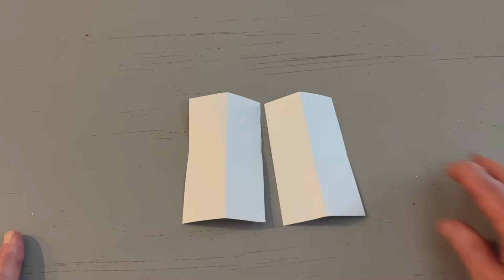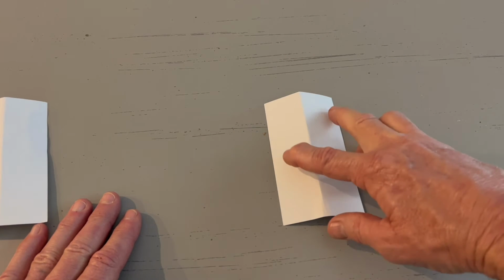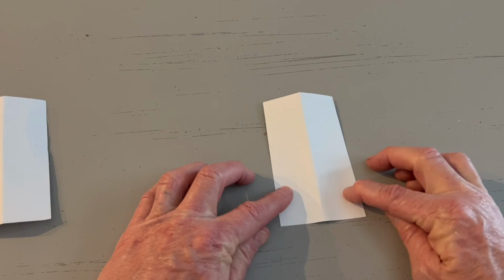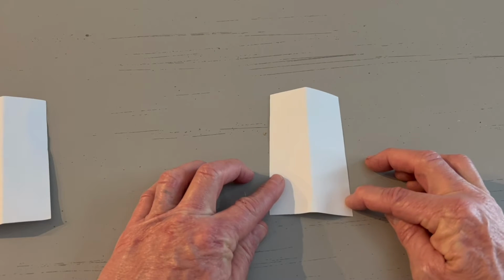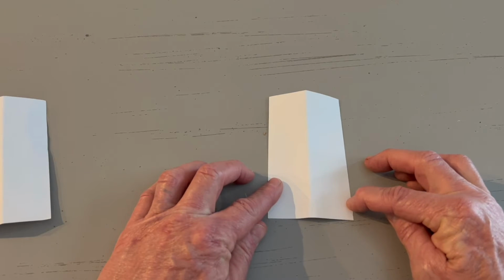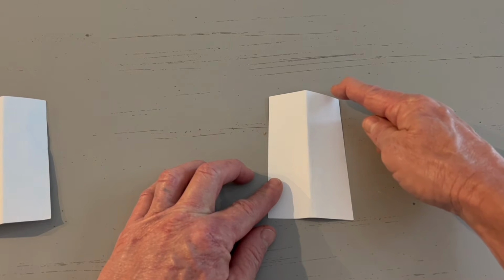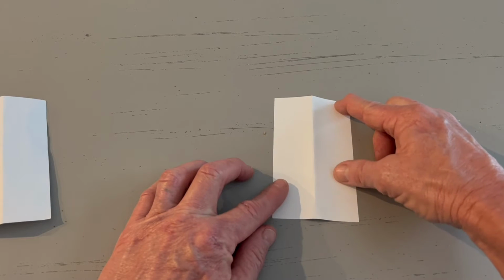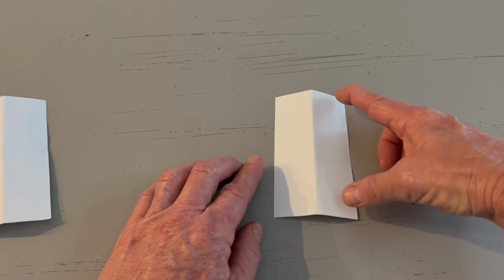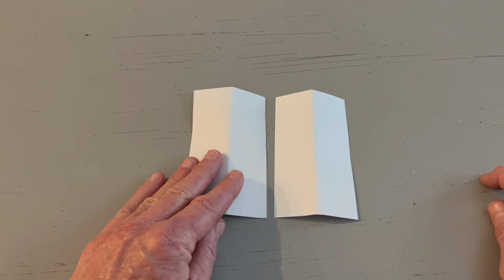So how do you do that? Let's leave this out of the equation for now. If you have to move this door, how do you do it? You can lift it up and move the bottom pivot on that bracket just like that. Or you can loosen the screw in that top bracket, pull it over toward the jamb more, and now you've moved it over. And then check it again.